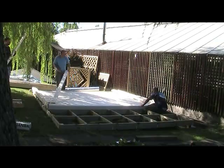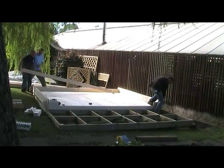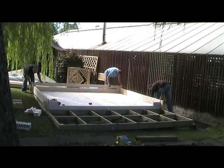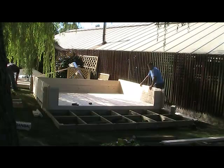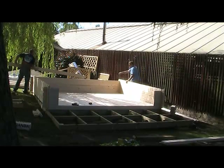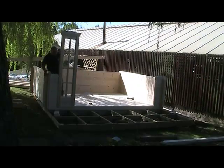Once the floorboards are laid, start to build the walls up. Timber locks or similar should be used on every log. Only on the side walls. By securing each log on the side walls, the rear wall and the front wall will automatically be secured where the logs interlock with each other.